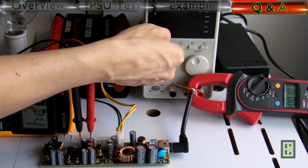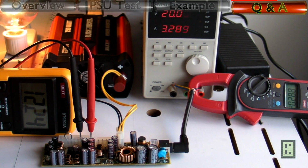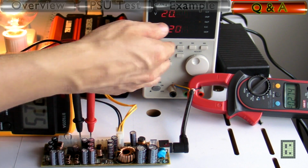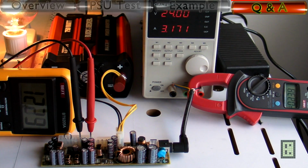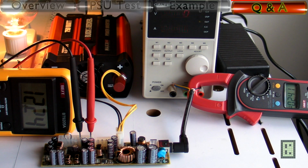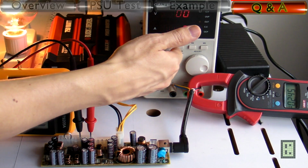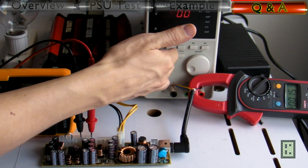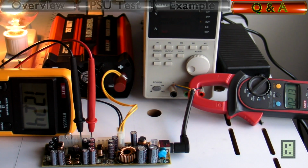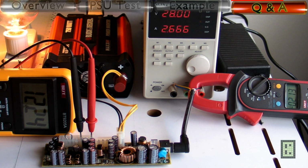The best will be to use something around 19-20 volt because it will be far from lower limit and it will be more efficient at higher voltages like 28 or 24. Of course it works at 24. It will also work at 28 and even 30 volt, but I will not recommend going over 28 volt.